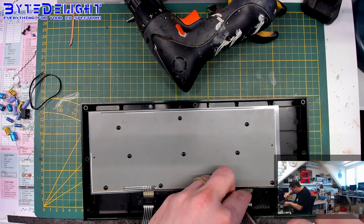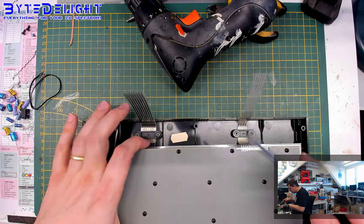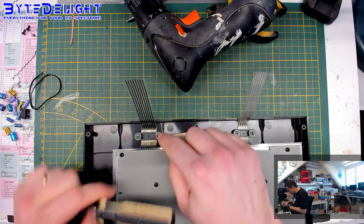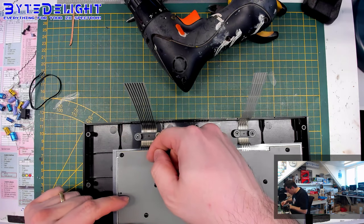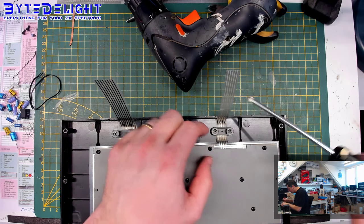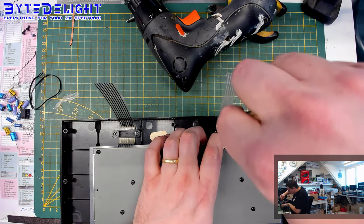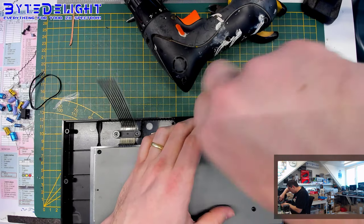So if you connect these two brackets here, I always personally pull back the membrane a bit here. Not press too hard because I don't want to break tracks. Of course, these membranes are new. And the reason I pulled it back is that when you tighten the screws and you release the tension, the edge is quite nice. There's not too much tension on the places there from the membrane, so the membrane is not stressed a lot. That's what I want to say.